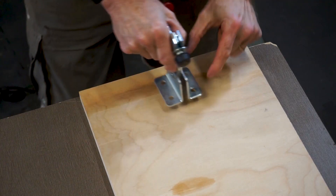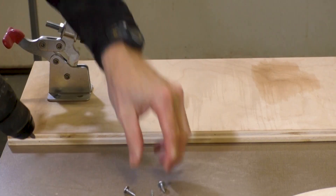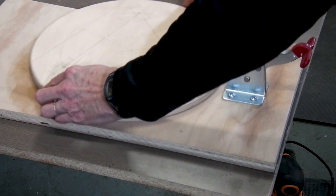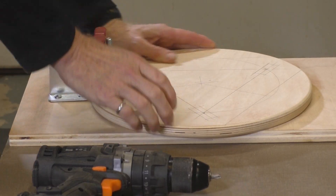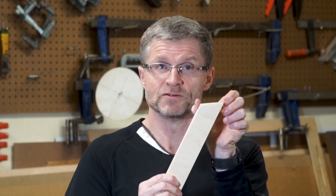I'm going to mount a clamp onto a piece of plywood to hold down the seat on the drill press when drilling the mortises. I was just about ready to cut when I realized I'd made a mistake — I'd marked the mortises at 45 millimeters to match the width of the leg, but since the leg inserts at a 60-degree angle, it's the projected width I need. I did a little math and it works out to 52 millimeters, so I re-marked the mortises and then began cutting.